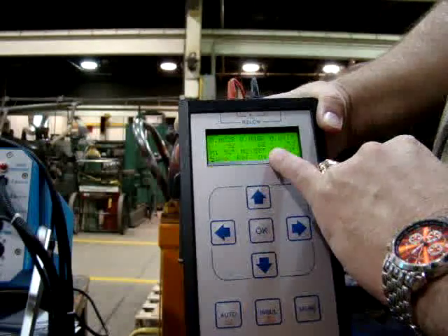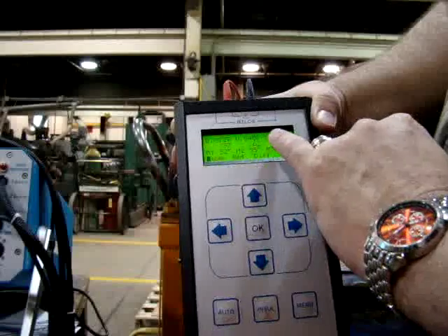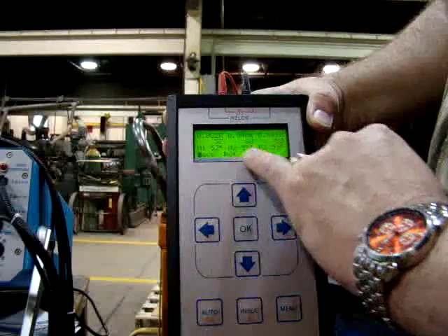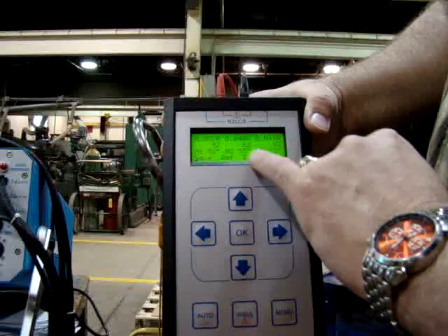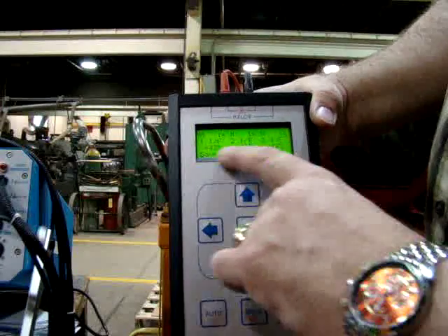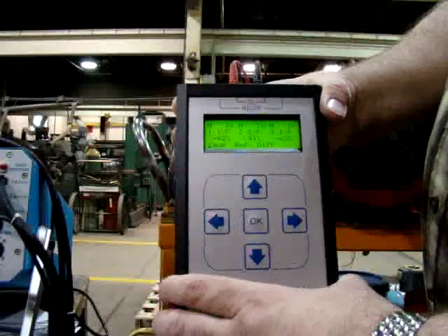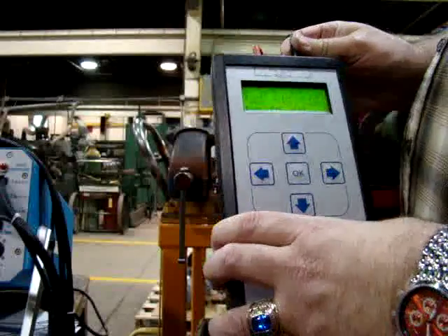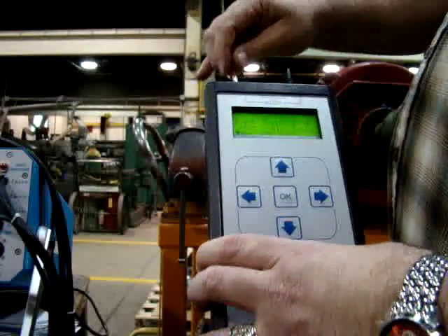What we're looking at here is we have slightly unbalanced resistance. The phase angle is off by more than one degree, meaning that we have some type of short. Measured balanced here and balanced here, so it looks like we have a slight short. What we'll do is change the shaft position and run the test one more time.